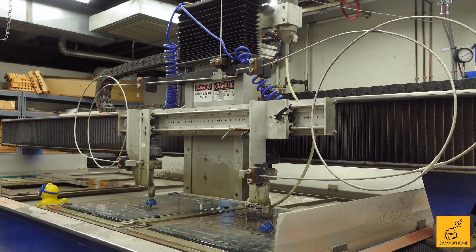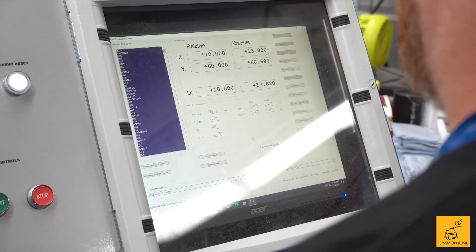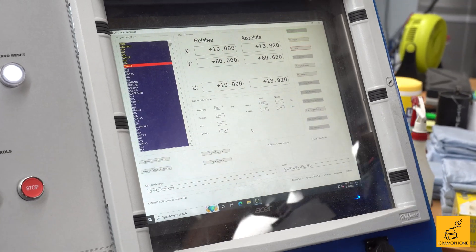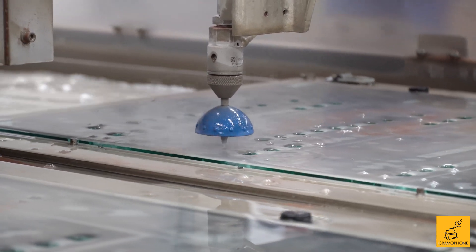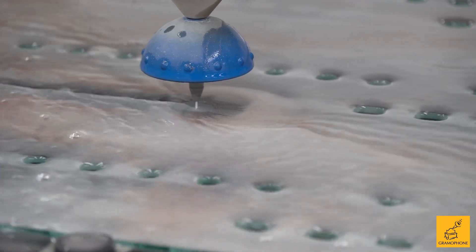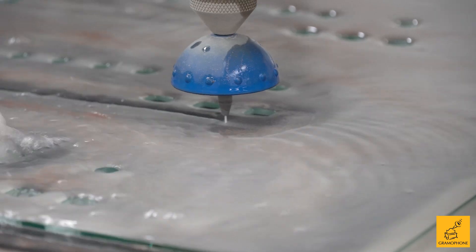Obviously, the process as to how we make the glass has changed over the years. Originally, we used to use abrasive drill bits and water as the cutting aggregate or coolant, and literally sit and cut and snap glass the old-fashioned way. By today's standards, we're actually on our third generation water jet machine, which takes the layout of the front panel DXF file, loads it into a CAD system resident on the water jet, and basically moves like a laser in an XY coordinate using very high pressure water, air, and a substance called garnet as the cutting abrasive. Any place we want to cut a hole, we make a pierce at 5,000 PSI.